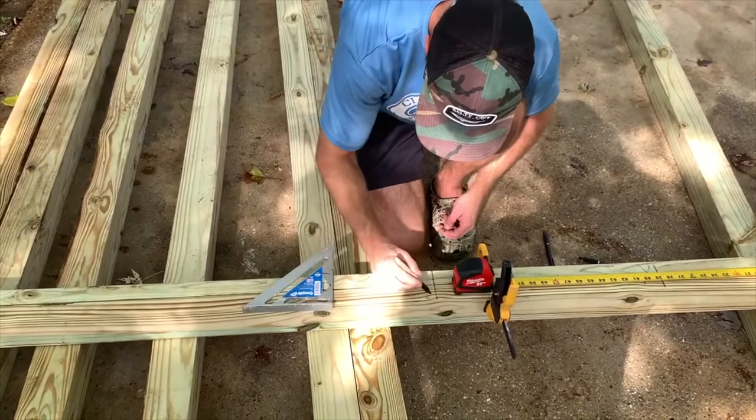Because the front wall has so many components, I recommend that you keep track of them by preliminarily placing them on the shed base frame as they will appear on the front wall, or you can label each piece or do a combination. But the moral of the story is make sure you keep track of your cuts and stay organized so that you can arrange your front wall in place on the shed base frame and keep track of everything in an organized fashion.